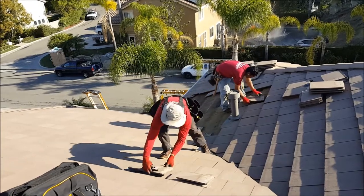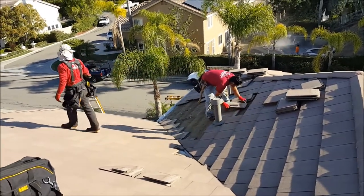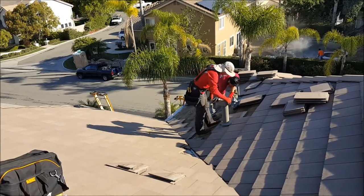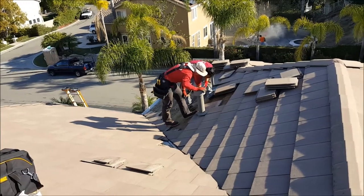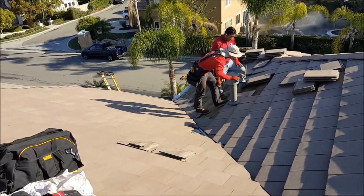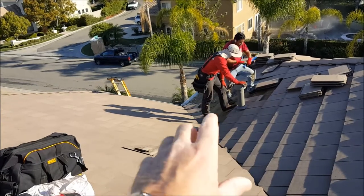She got another bid to do a real tiny repair — like 50 square feet — and it wasn't really too much cheaper than what we're doing. But we're going to end up doing an area that's probably three times what they said. We're really going to find the problem. We're gonna put ice and water shield at the bottom — there's a high water traffic area. You can see all the water from this side, from here, all ending up down there. It's probably worn out the paper, so we're gonna fix that. We'll run it up the middle and tie in and weave the felt, pull out this piece of valley.